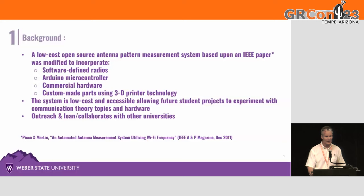Quick background: these are similar to what Matt presented last year. It's a low-cost, open-source antenna pattern measurement system based on an IEEE paper that used Linksys routers and pretty much equivalent to Home Depot hardware. We took that idea, rebuilt it, had the same problems they did, then upgraded by going to software-defined radios and GNU Radio Companion. What was not around when the original paper came out were 3D printer hardware, namely synchronous belts and gears, available at low cost. We also have custom 3D-printed hardware pieces, including a masthead that was student-designed and student-built in our engineering programs.